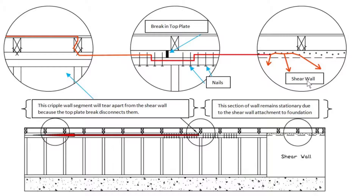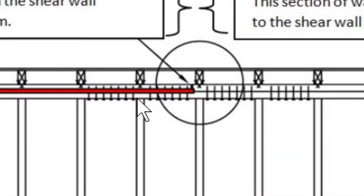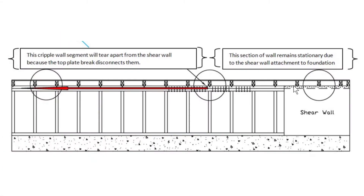Let's look at the big picture. Here we have the break in the top plate — this entire cripple wall and floor is disconnected from our shear wall. Now we've put a whole bunch of nails on this side of the break and a whole bunch on the other side. When the earthquake force comes this way, it travels through the nails into the lower top plate. The nails in the upper top plate connect to the lower top plate, so the lower top plate moves this way, comes over to the nails on the other side — those are connected to the upper top plate — and all the force gets pulled into that upper top plate and transferred into the shear wall where it belongs.